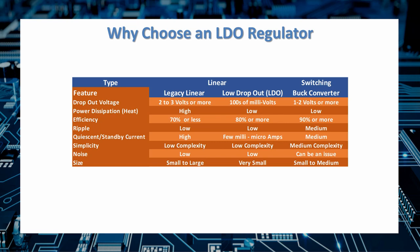That low noise is a big advantage over switching regulators where noise is an issue, such as when seeking FCC certification for a product. LDOs are also very simple devices requiring no more than the regulator itself and a small capacitor at the input and output. In addition, LDOs are very small in size — some are as small as an SOT transistor.